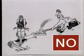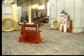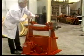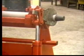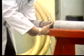Always work safely when dismantling down the hole hammers. Halco's range of hammer stripping benches is designed to make dismantling easy. The hydraulic version is fitted with a hand-operated pump. This gives the effortless, smooth power needed to break the top and bottom joints so that the chuck and top adapter makeup assembly can be removed.